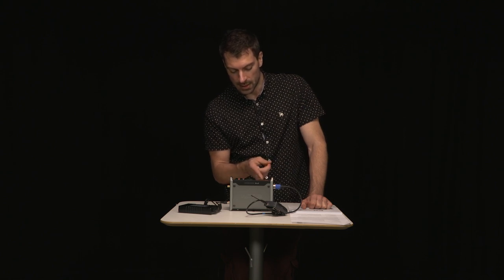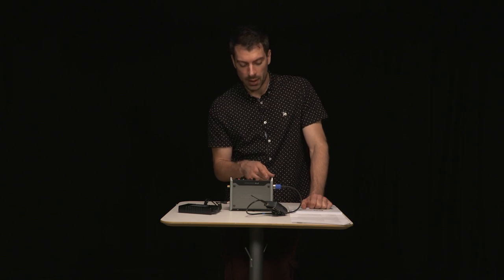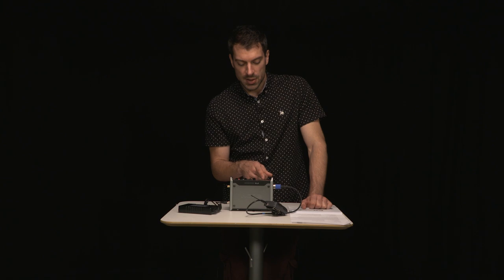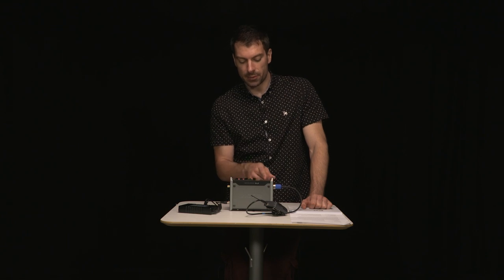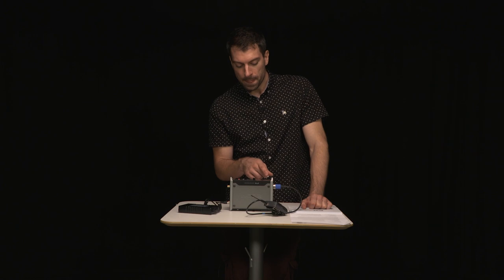And you can see the time code here is running. So it's generating time code if you wanted to send it to another device. But yeah, I'm just recording one microphone here. And the reason it's appearing slightly louder in the left right to the input is because the left and right volume is set independently from the input gain. So you might see a slight discrepancy there.